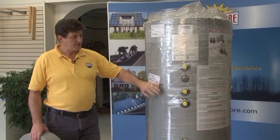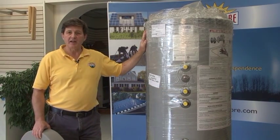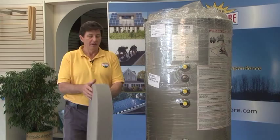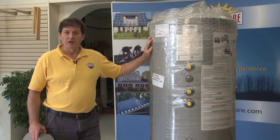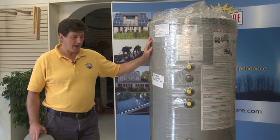Normally this plastic would be off, and you might ask why is that such a big tank? Well, part of the reason is it's highly insulated — you can see the thickness of this insulation here. There's a jacket that goes around this tank and it makes it a very efficient tank; it only loses half a degree an hour, so it's a top choice for a solar hot water tank.